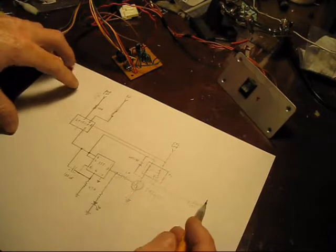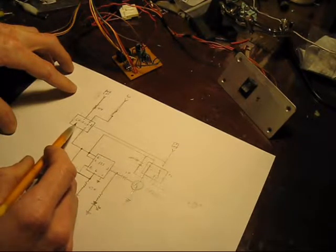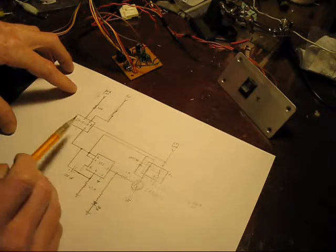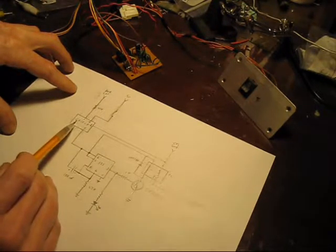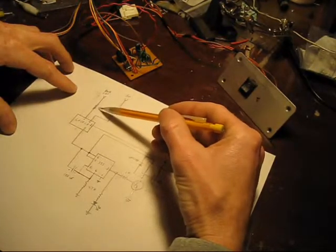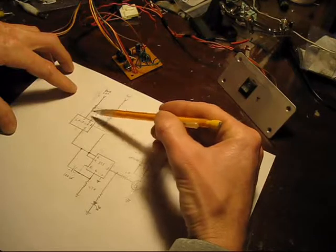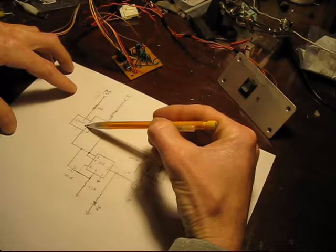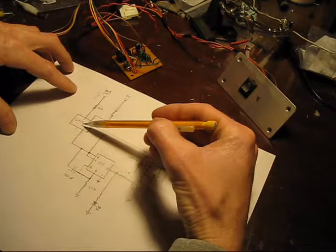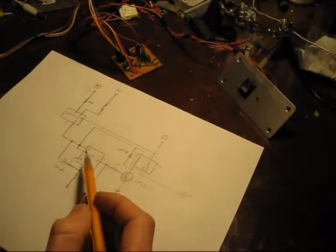There are a few reasons I did it this way. The LH1511B is the only component I actually bought — everything else was scavenged. I chose it specifically because I wanted a normally closed relay in solid state form, figuring it would be more reliable and draw a lot less power, which is important since it's activated pretty much any time the TV is on. The only resistor worth mentioning is a 470 ohm: the power light on this TV runs at about two volts, but the solid state relay only wants to see about 1.45V max, so the 470 ohm drops the voltage and current low enough to protect the component.